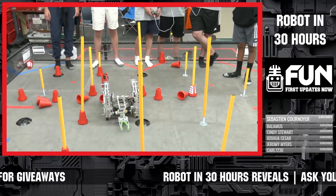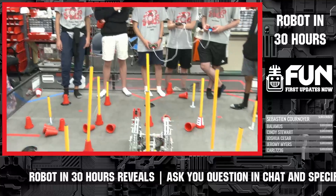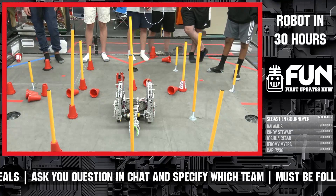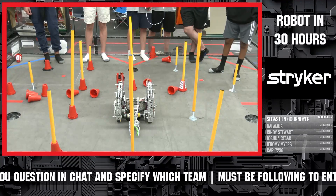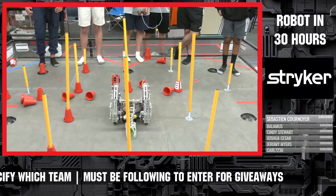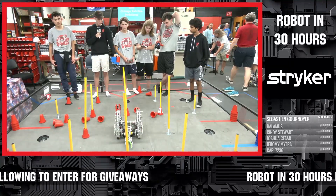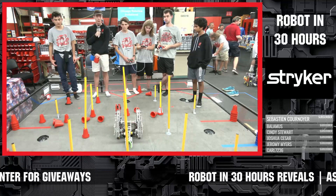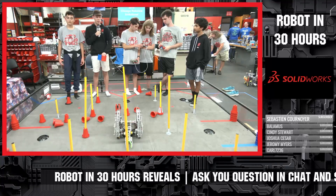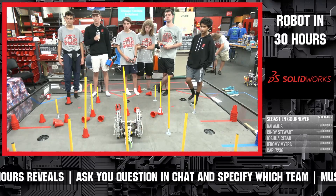Regarding the five-pound weight — would there be something else you might place instead of it to lower your center of gravity? One thing we're talking about is something that would knock tipped cones upright — as you can see there are a lot of tipped cones on the ground here — so we could easily grab them with the claw. The weight of that mechanism would also add to the center of mass at the bottom.